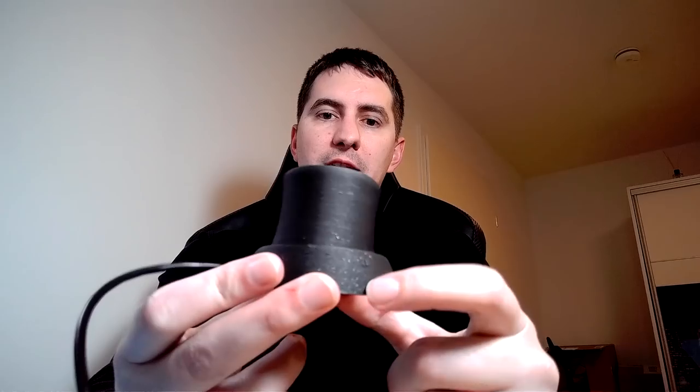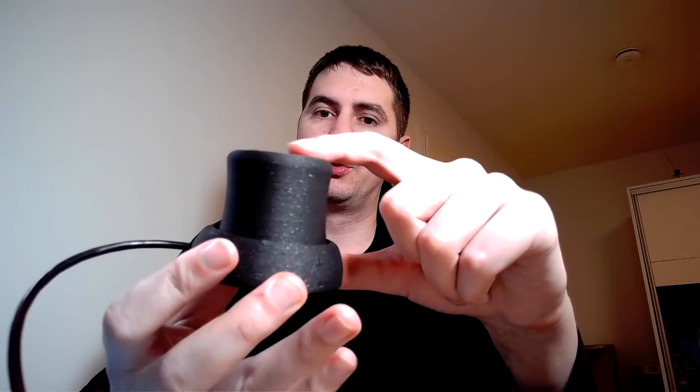Let me explain how it works. It has a base — this bigger circular base — and a top which I can tilt in each and every direction. The original 3D Connexion space mouse works similarly, but it uses springs and optical sensors in the top of the unit which sense the angular motion and sliding in each axis, and this is how it calculates the movements.